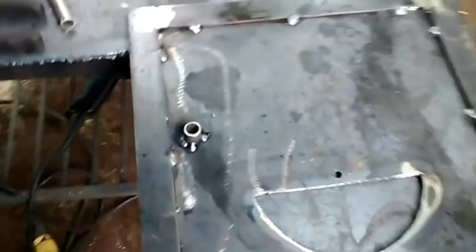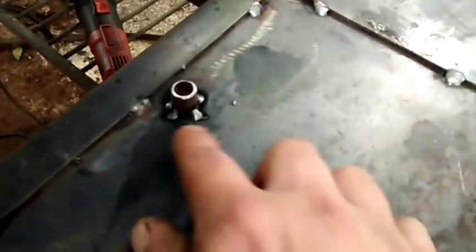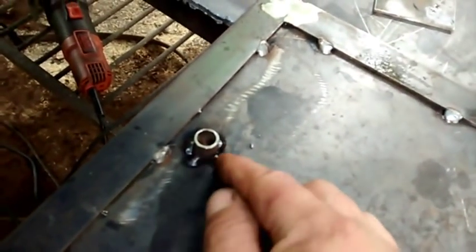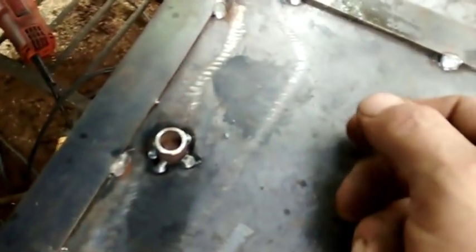All right, I got that piece put in there and all I do is put a few tacks around it — good tacks to hold it. Because if you try to weld all around it and you bleed through, you're gonna have to take a round file or something to try to eat it out, because it's a real tight fit. It's not going to go through there if you bleed through it with the weld. So really just enough tacks to hold it on there good.